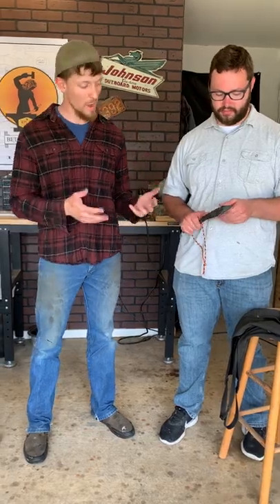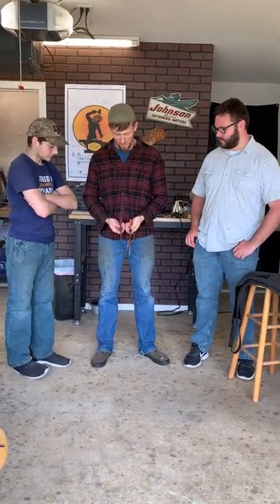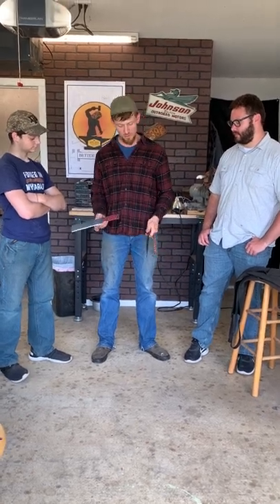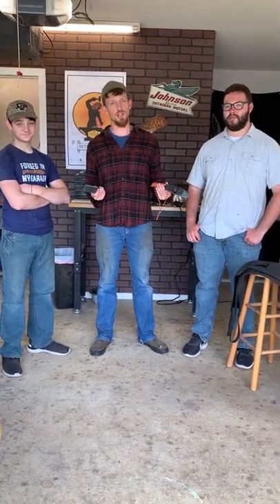The ergonomics as well — that was another really big aspect. Y'all both built choppers, and this is a diehard ergonomic chopper. When this thing swings, the forward weight and that heavy edge, it just lops out. The other reason why performance was given to him was his spine is thicker on the handle and it held better. When I was swinging yours it rolled in my hand because it's a little thin through there. This one finished out better. This one chops better. Subscribe to our channel, go to our Patreon, become a Patreon supporter, and leave a comment below who you think the clear winner was. Maybe we'll do this challenge again with more people who've had lessons with us in the past. Stay sharp, my friends.